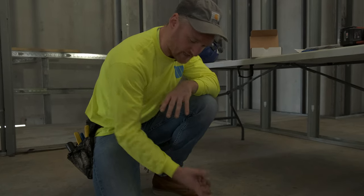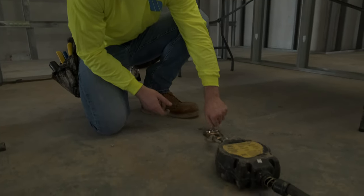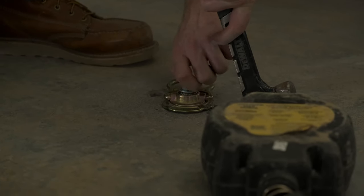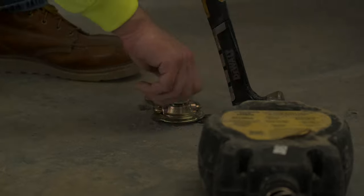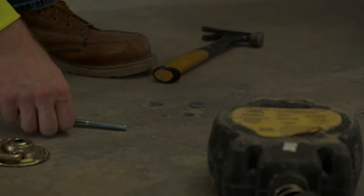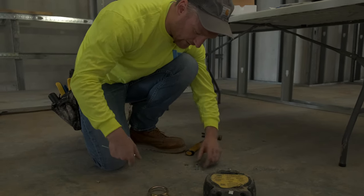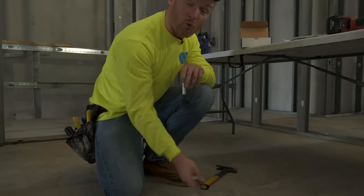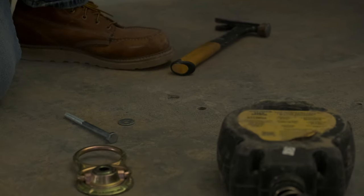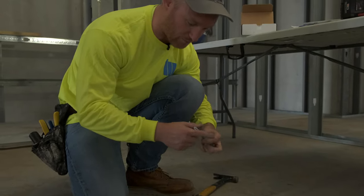It's not necessarily thick enough for this particular application, so we would have to find something a little bit shorter. As far as removal, you would just take this bolt out and unclip this. The cool thing about this one is — watch — once I pull this off, I pull the washer, pull this off, and then pull out the sleeve. So I don't have anything I have to go back and cut, or that anybody could stub their toe on or trip over. The expansion part remains in there, but we're able to get this out, and now you've just got a bolt you can toss away — you'll just get a brand new anchor, which is what you're supposed to do anyway.